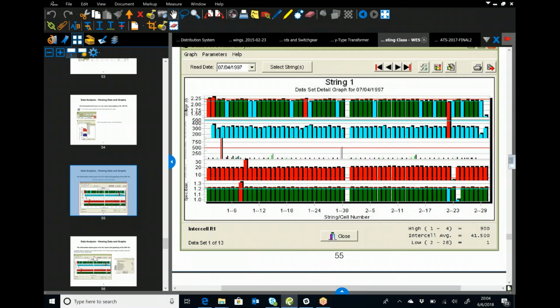So if they've been in there 3 years and we go in and test, we're making an educated guess either based off of the knowledge we have on those jars and how they perform. We're doing it off of their previous data that they have, or we're taking a shot in the dark and saying, okay, right now the entire string together looks like they're all about equal. We'll run a capacity charge or a capacity discharge, and we'll compare specs, and we can tell them whether they're in good or bad shape. But we're not going to sit there and tell them, you've got 3 months left on these jars and then they're going to fail. It's predictive analysis is what we're really looking for.